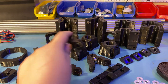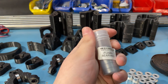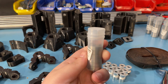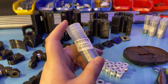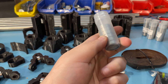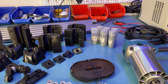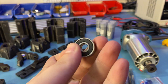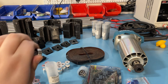I assembled four of these parts with the bearings just to do a test fit. I'm going with Fushi brand bearings. While they're not a premium bearing manufacturer by any stretch, for an AliExpress seller they make decent enough bearings — I'd say only Reindew makes better bearings than them on AliExpress. I bought 60 bearings and only paid $12 thanks to the 11.11 sale. They spec the ZZ type (metal seal), but I went with the rubber seal type, which is usually more expensive.